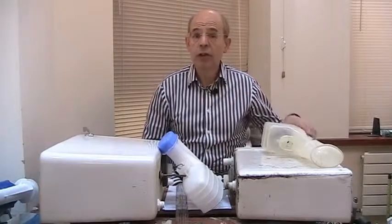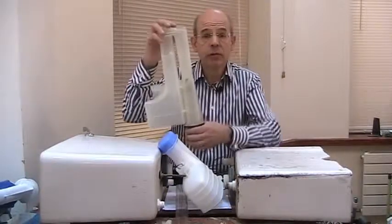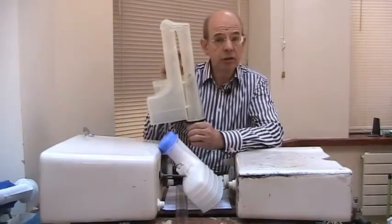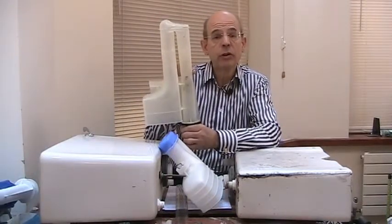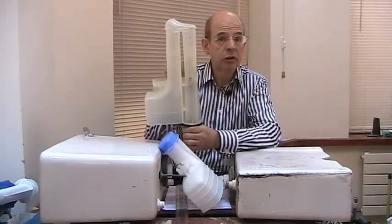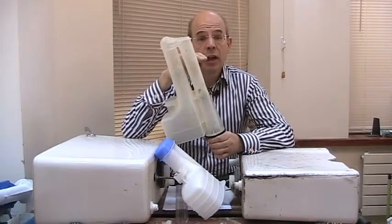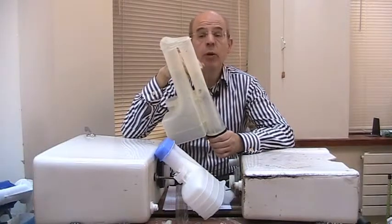It might be that you've got a really old cistern. This one for instance works out at 12 inches. I'm not sure if you can get them that tall these days, but the water level was up to nine inches and what I did in this case was choose a nine inch siphon because I knew I'd be able to lower the water level enough so the water didn't go straight over into the siphon. I almost always fit eight litre siphons because with taller siphons they have a large flush volume and I can lower that quite easily. I'm going to show you that in a moment.